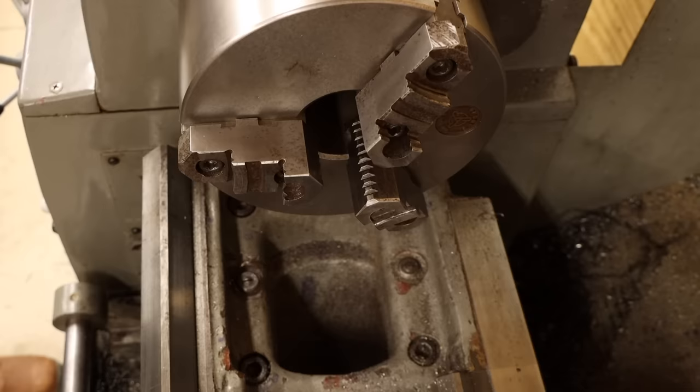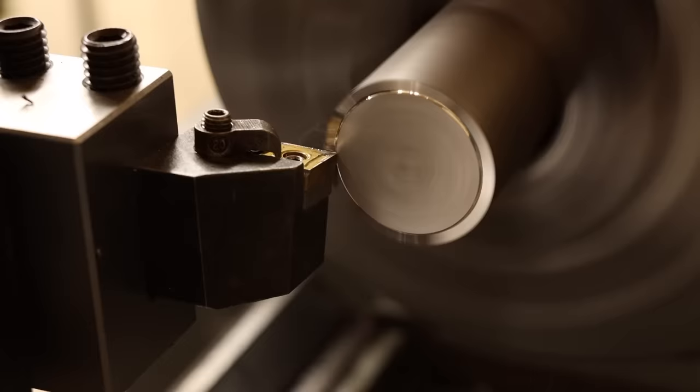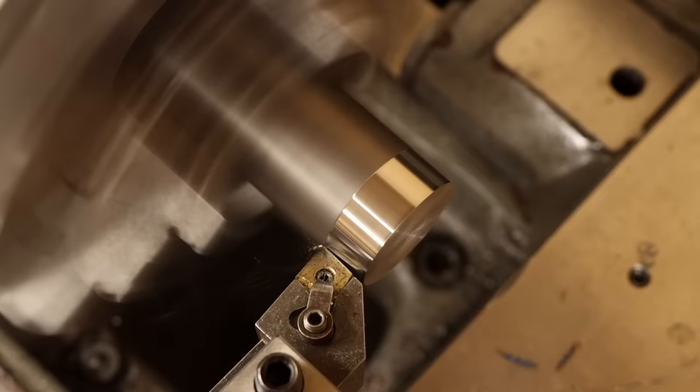Now I can move on to the centering boss, which, hopefully, goes more to plan. I went ahead and cut enough stock for the cap as well, just to economize on holding material. This boss is short enough to be cut without tailstock support, so after facing the end, I can move right on to hogging away the outside. I'll get it within about 10 thou, then drill out the bore.